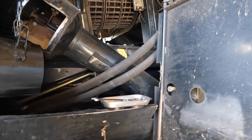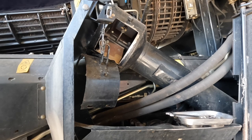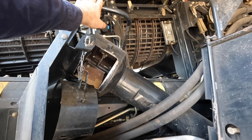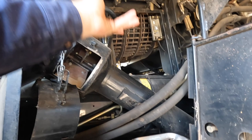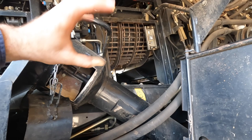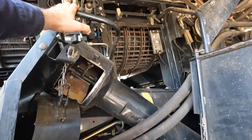It's always hard getting the rotors back in. It is pretty straightforward taking them out, but what we have to do is take the back section of the concave off, and that way we can get something in there and pry it off. We can actually lift the back of the rotor up, because it needs to be lifted up to line up with the drive gearbox. It needs to slot in there, so it can be a bit fiddly trying to get it set right, but not too bad considering.